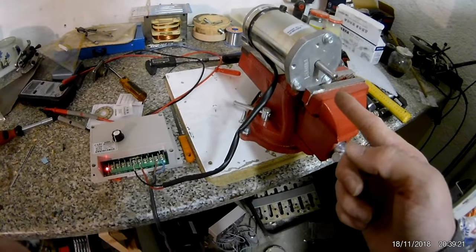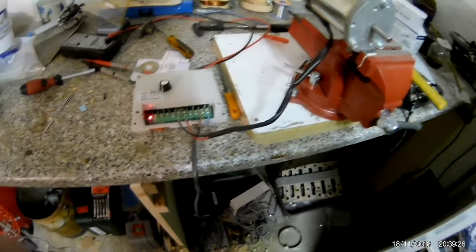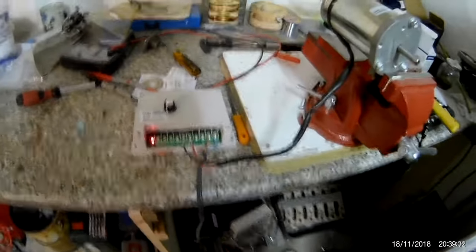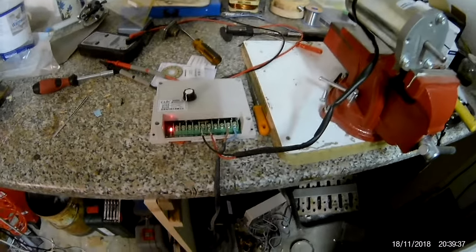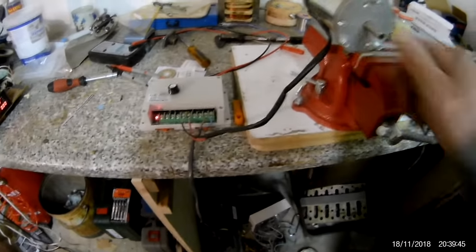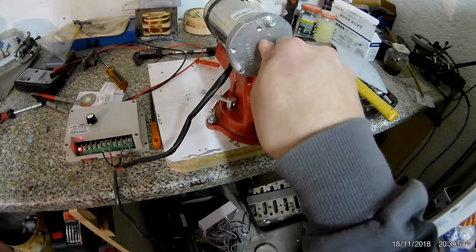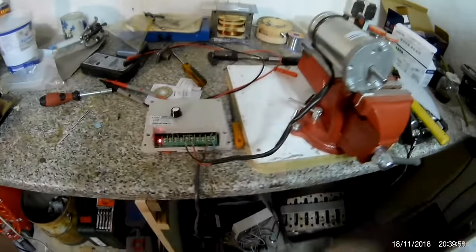Also, this is a small motor. I do not know what happens if this pulls any amount of amps. So maybe this is just under the threshold of the device. I did that with a similar motor, a 230 volt one, and put it on a triac, which is basically two thyristors in one package, and the triac was able to turn off because the thing didn't pull many amps, but as soon as it tried to block it, it did that.